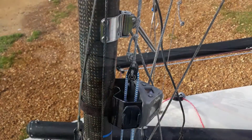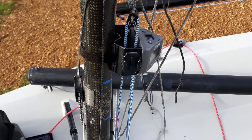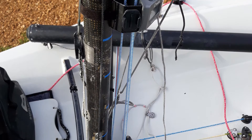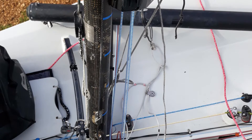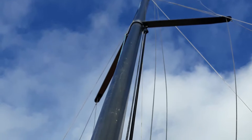That is then attached either by a 2x2 cascade or straight into a 4-to-1. A cascade system has less friction but is limited in range — we were finding we were maxing it out before we switched. Sometimes when releasing the downhaul it will struggle to go all the way off due to the tension in the take-up elastic bungee, the friction in the 4-to-1, and the friction in the mast track.